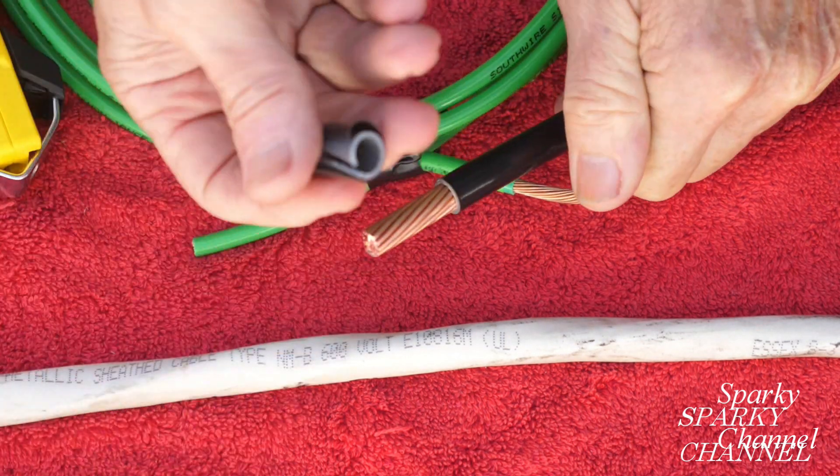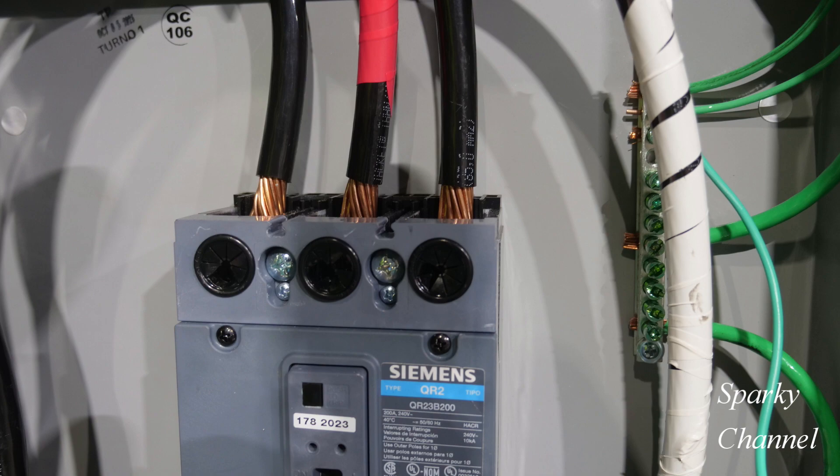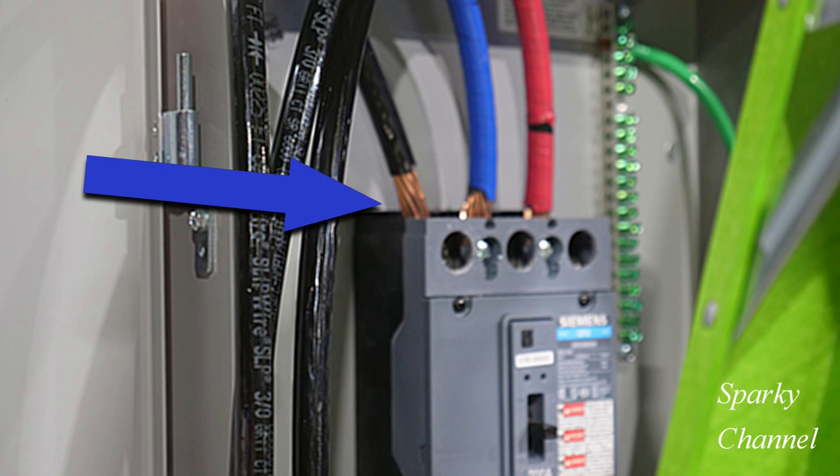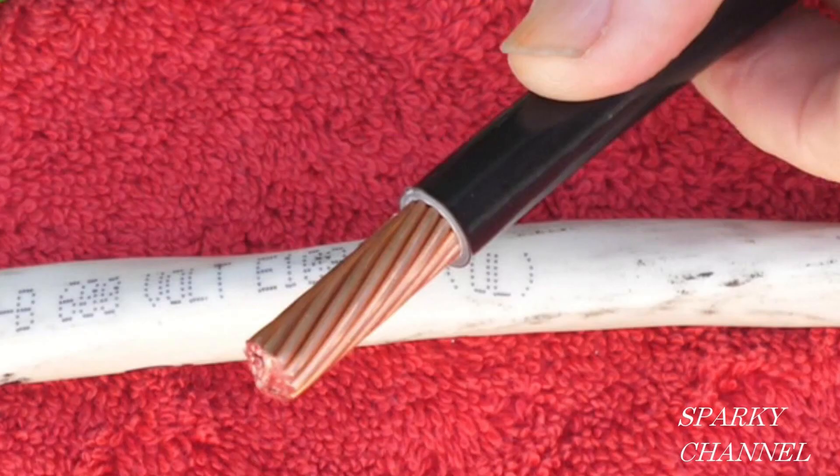Also, it may be that different inspectors will have differing opinions on how much copper should be showing, so perhaps it would be wise to discuss this issue with your electrical inspector. Certainly all inspectors are going to want to see the work done in a professional and skillful manner. As to my personal opinion, I would say that if a human finger can easily touch the copper between the insulation and the lug, then too much copper has been stripped off. If an inspector can't easily tell that no insulation is under the lug, then not enough copper has been stripped. I think it's a good idea to do a dry fit into your lug to make sure it fits the way you want and that your work is consistent.